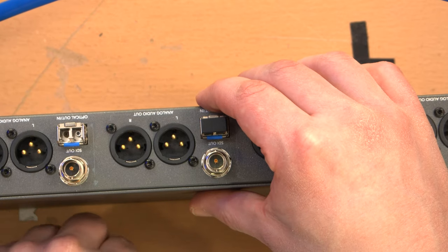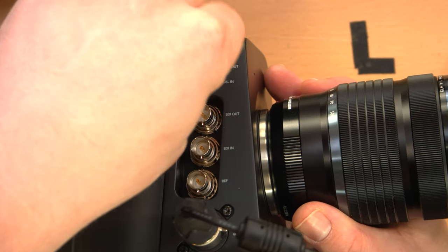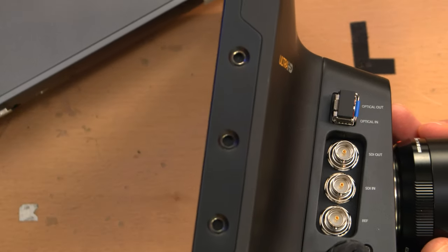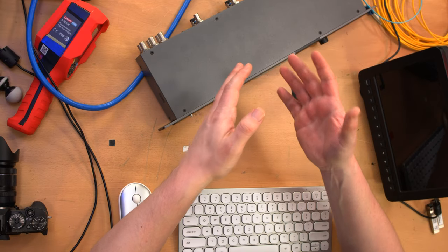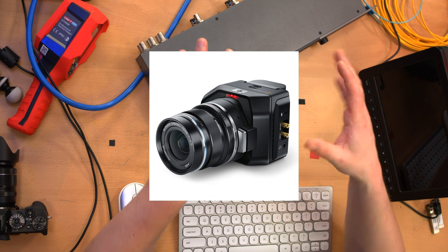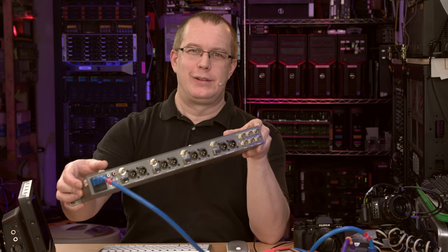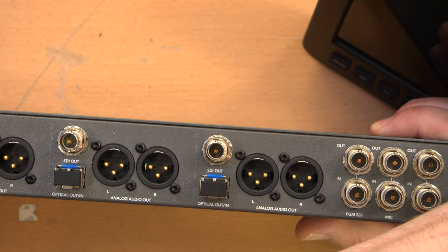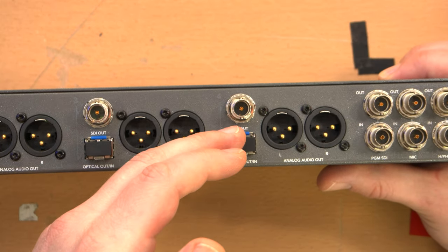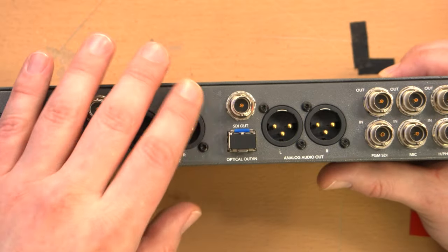You will need SFPs in order to use one of these with a fiber optic link. I was also lucky that one of the studio cameras I had purchased used came with an SFP already in it. So I actually have four SFPs from the studio converter plus one for this camera — more than I need since I only have two of these cameras. The overhead cameras are Blackmagic Micro Studio cameras, and they don't have any fiber optic capabilities without a separate converter attached.